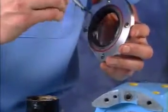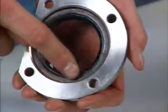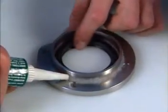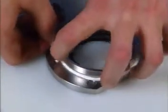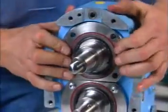Install the grease seals into the bearing retainers with the lip facing out. Coat seal lips with microplate number 555. If your pump is a Model 30, you'll find the grease seal has to be pressed slightly farther. Coat the bearing retainer flanges with silicone sealant. For the Universal 2 paint pump and other silicone-free pumps, use Gore-Tex sealant. Then install the bearing retainers.